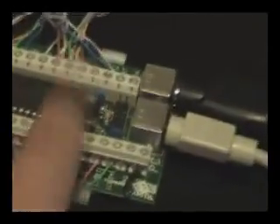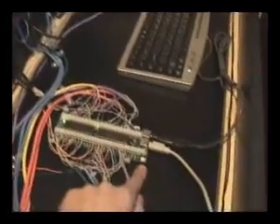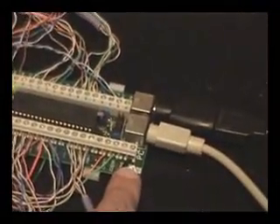For iPAC 2s, you only have about half of this — two over here and one over here — but it's the same concept. Getting back to the ground, there are only two ground points on the board, so obviously you can't put all the wires into that one spot. The easiest thing is to daisy-chain them — connect a point here, then to there, and so on throughout the whole control panel. I have mine leading from underneath the board, coming up into the one ground point.